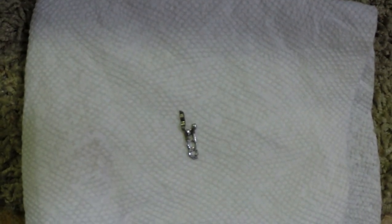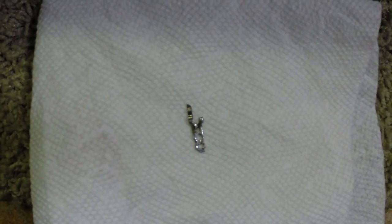So what was happening — this tube was actually losing bias intermittently. I couldn't see it because it was hidden down in the socket, but I found it. I'm not done digging yet. That's one problem.